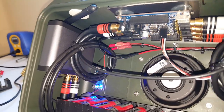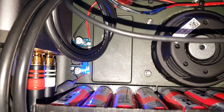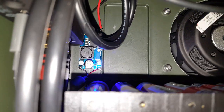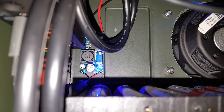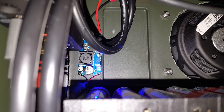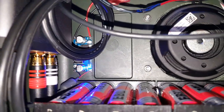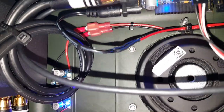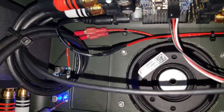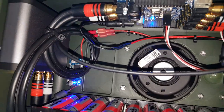The Audio Engine B1 is powered on 5 volts, so I had to use an adjustable DC-to-DC buck converter. You can see the little blue potentiometer with a brass screw — you use that with a meter, adjust your voltage, and you're set. I have it connected to quick-disconnect terminals just in case I blow it up or need to swap it out.